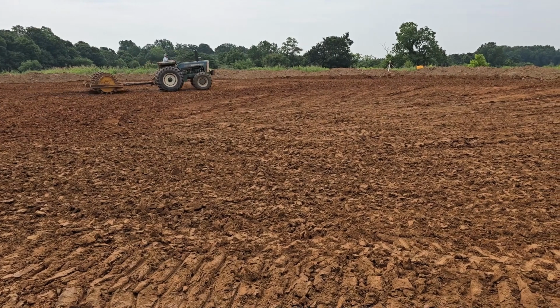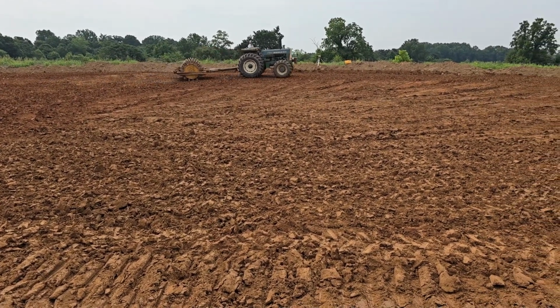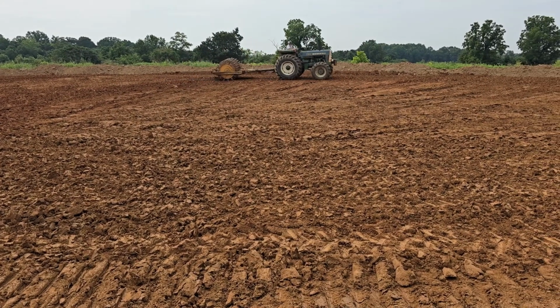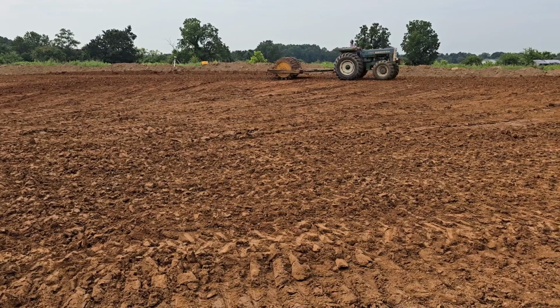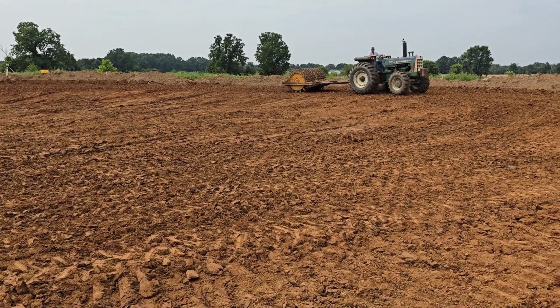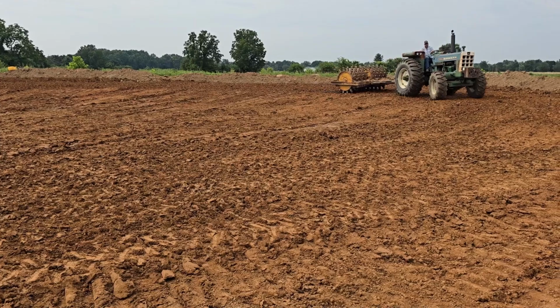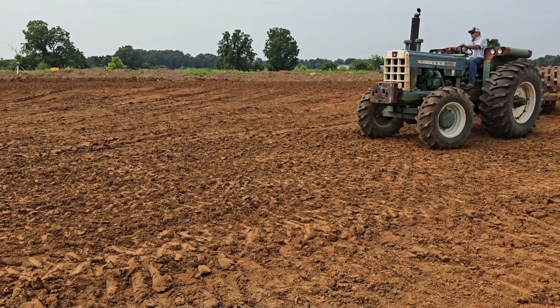We decided to use the compacted clay liner technique to build the wetland because it was not possible to build a groundwater dam, and no groundwater entered our test hole, and the layer of clay near the surface was at least 4 feet thick. If we simply dug a depression for the wetland without lining the basin with compacted clay, the wetland would only contain water a few days out of the year, and the soil would go dry.